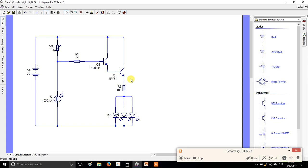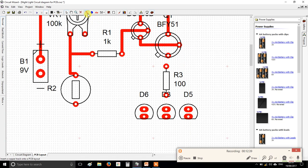We're going to now move on to, so I've done this, done that, I've done pretty much all this top end. The transistor connects to the 100 resistor, and the 100 resistor connects to all three anodes. All good. So, here's my transistor, here's my 100 resistor, that was an easy one. These must be the anodes, because I spun them around that way already. Okay.